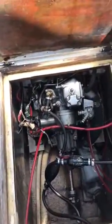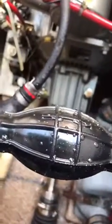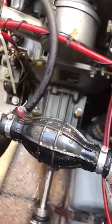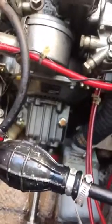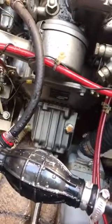So in order to fix this problem, the first thing I did is I originally tried using a little fly valve down there to manually prime the engine, but that did not work because there's sediment in there and I didn't know it. So after I got some advice, I attached this bulb here to the incoming line from the fuel tank, and I blew all the sediment back into the fuel tank, which probably wasn't very good, but it had nothing else to do with it, and I don't know how far back that was going, but you could literally get no flow through that line at all.